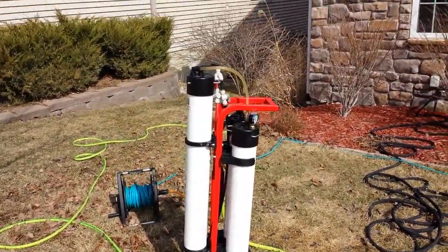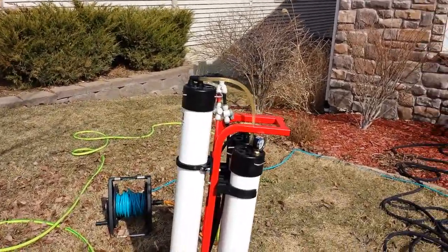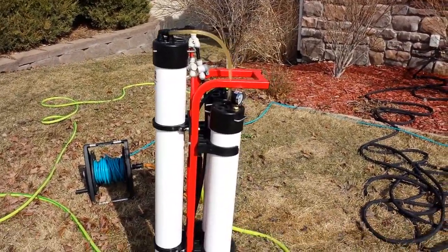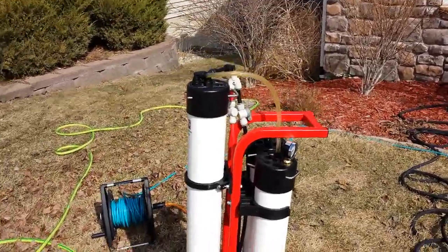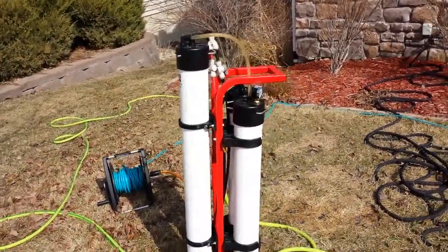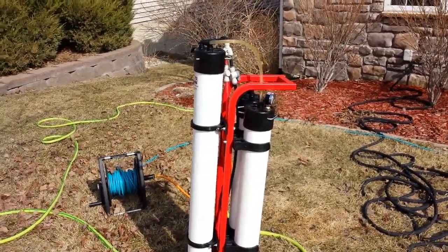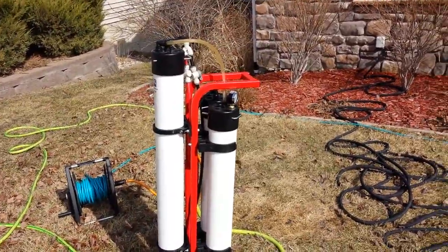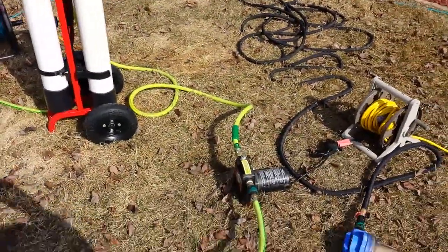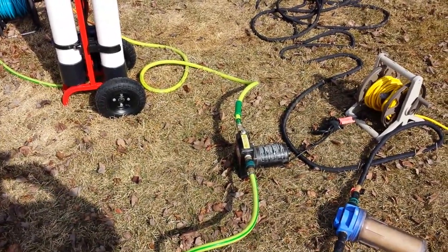Here at this house I was doing 40 psi with just the tap pressure when it was coming into the system. I really think the single RO is a little better for building pressure, because this pump is rated to boost your incoming tap pressure by about 40 psi.